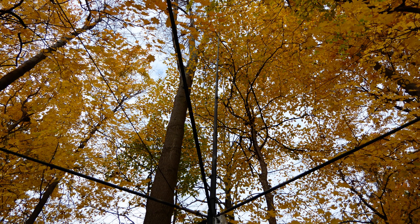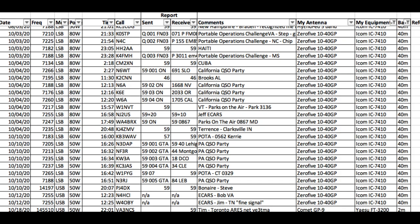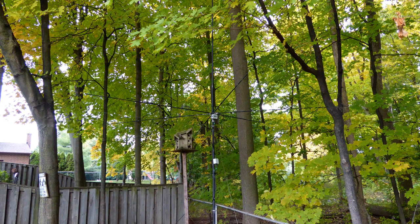Now that I knew the SWR was as it should be, I started to make contacts. In the first few weeks I had it up, I operated multiple times on 40 meters. First up, I had a nice chat with Brian, KB9ZPK, on 40 meters — Brian is in Wisconsin and we had a nice sustained chat for almost half an hour. One day on the ECARS net when I checked in, the net control operator expressed interest in the 05. He gave me a 5-9 plus 10 report and asked other stations listening to give me a report. Several stations along the US eastern seaboard responded, all giving me reports of 5-8 or higher. That was a very good result for what I had considered to be a compromise antenna for tight spaces.